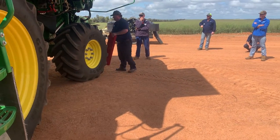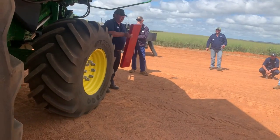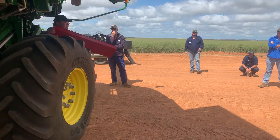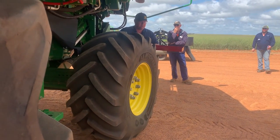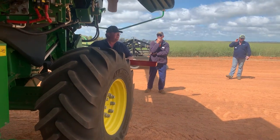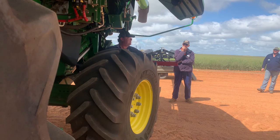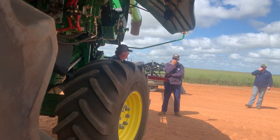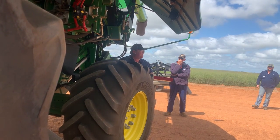With the tray sitting at the back axle, we drop it, we do a test on it, we check it. Once it's on the ground, don't just go out and pick it up and throw it away. Have a look in here and see what's going on — see whether you can see a pattern, see whether you can see grain on the right hand side or grain on the left. Sometimes when you get a leak in your machine there will be a nice little stream of grain going straight through it.